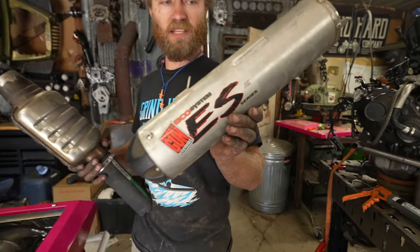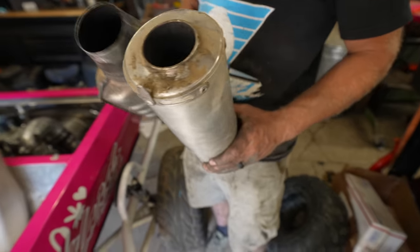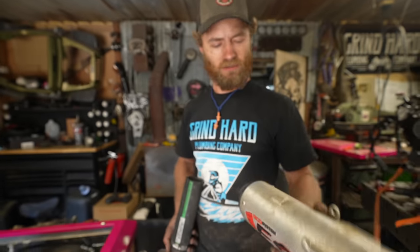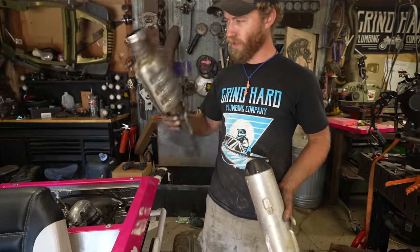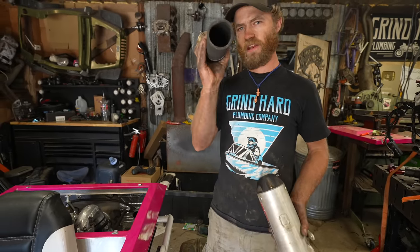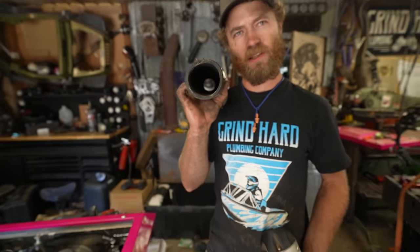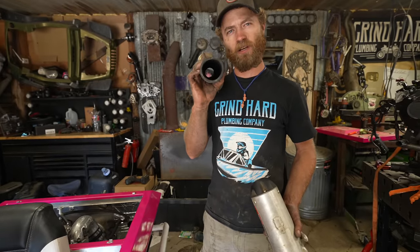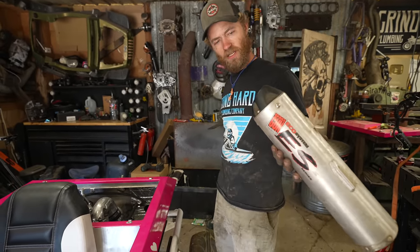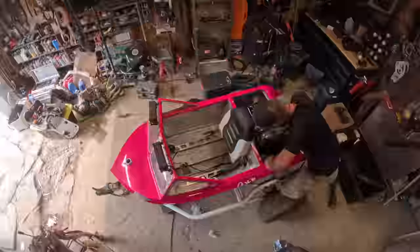It's a muffler from an ATV. It's pretty close to the same diameter internally. No restriction whatsoever. It's a straight pass-through, just a glass pack muffler. And also, what really got me thinking about it is I looked at this and I had it mounted in such a way that it's straight through, but there's a little baffle in there, and I think I might have had it backward in the sense that the baffle would have been causing undue turbulence. So I'm gonna see if I can find an easy way to mount this in there. It fits lengthwise.